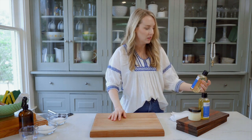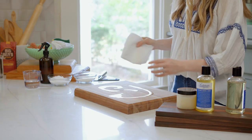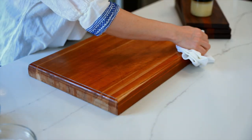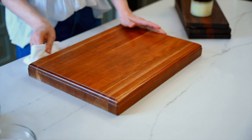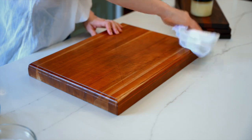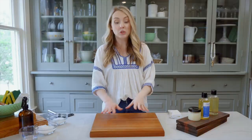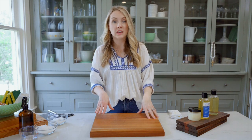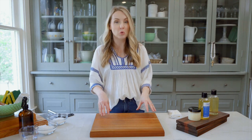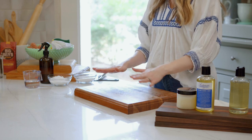We're going to start with a little of this butcher block oil. Pour it on there and then take a clean cloth and wipe it around — you'll see the wood starts to soak up the oil. You want to get the top, the sides, the bottom, everything. You can do this on a cookie sheet if you're worried about making a mess, or in your kitchen sink as long as you don't turn the water on. The goal is to get every bit of that wood covered in oil. Once you've got it completely oiled, let it sit for a while to soak in — you can let it sit overnight. I like to do mine right before I go to bed, and then in the morning if you see any dry spots, apply a little more oil. That way you know it's good and moisturized.